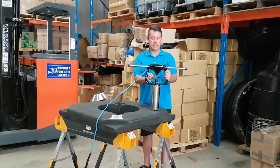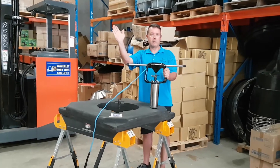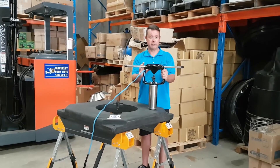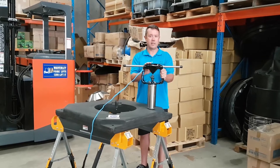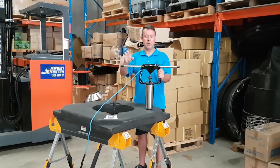The propeller here — you can see it's a very simple design. The prop just spins around very, very fast. The water gets pushed up here and then goes outwards. It's like having an outboard motor sitting in your dam — it moves a hell of a lot of water. Because it's a propeller, it's not necessarily a decorative type fountain. The fact that it's got this diffuser here does create somewhat of a decorative effect — it'll go like an upside-down cone.